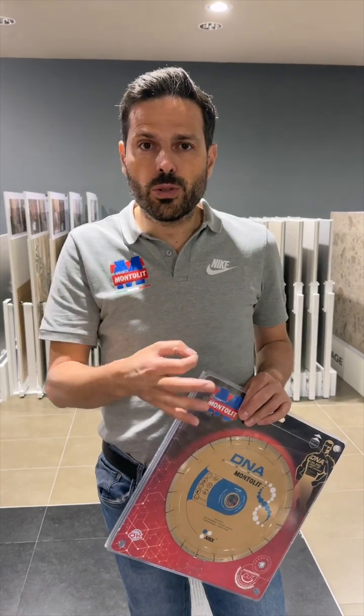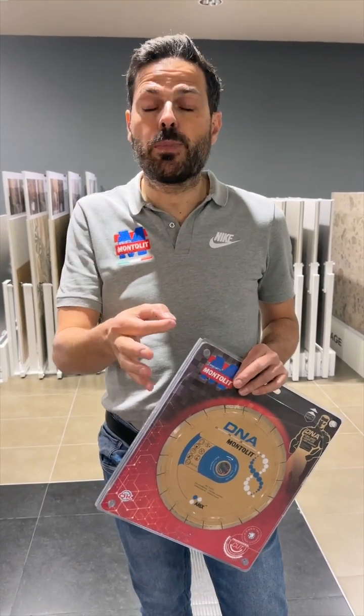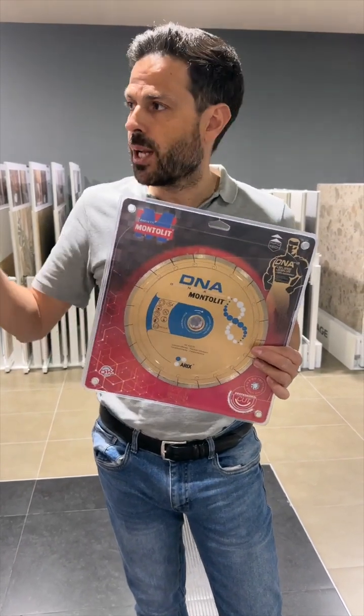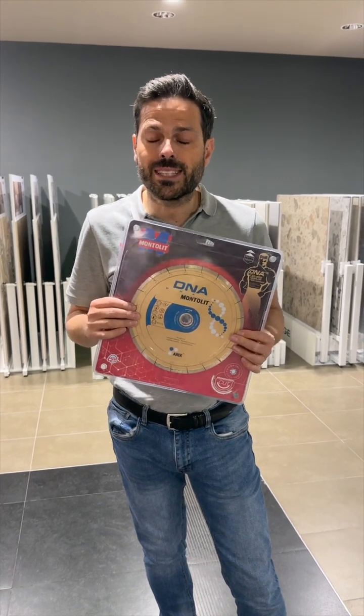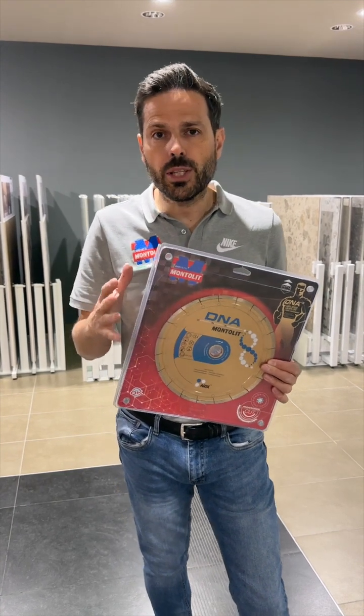I told him, I didn't have the machine at that time, but I have my videos. With this blade, you just keep it clean with a dressing stone and you go through extremely quickly. I did a test, probably 20-25 seconds or less per tile, and we are talking about 2 cm. This blade is designed mostly for standard porcelain, like the one we see here now, 14, 10, 6, 8. So imagine the performance this blade can have in standard hard porcelain tile, if it cuts so easily through 2 cm. So guys, you are our distributor, you need to be very confident on this.